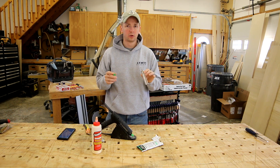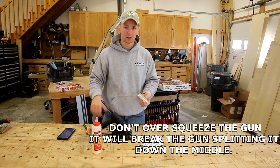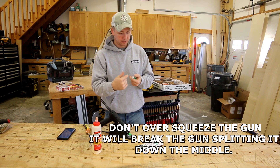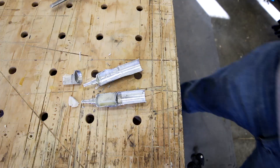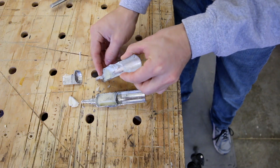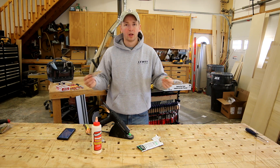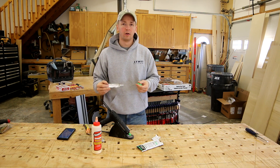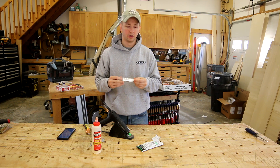One of the most common problems with new tubes is that sometimes you heat them up, go to dispense the liquid, and it's jammed — plugged and you can't get the liquid out. For me, I'll take a drill bit and drill that out, which sometimes frees up the check valve area and allows the glue to exit. Other times the tubes are just junk and I throw them away. Usually I'm on a job site — time is money — and I don't have time to spend half an hour on a tube. I'll give it a shot with a drill bit, but if it doesn't break free, I'm just going to throw it in the trash and move on.